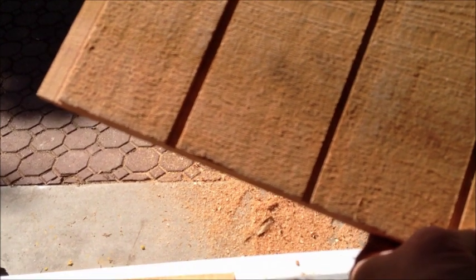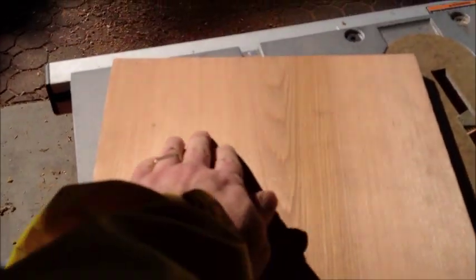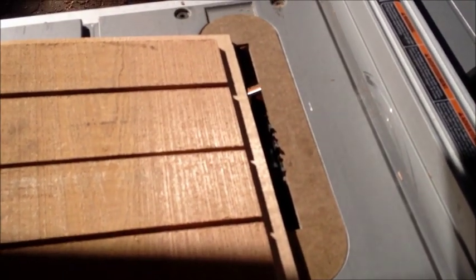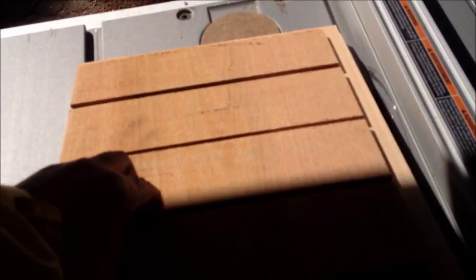We don't want one on the flat side because that's going to be the bottom — I'll staple in some plywood under that. This is a little trick I learned as well. So there's the almost finished board looking good. What I want to do is cut some handles in here, just a handhold, and it's so simple. This is a dado blade, three-quarters of an inch, and I set it just low — maybe a quarter of an inch. I'll take this board, center it so the middle part is on the blade, put it over on the fence, then just drop it and roll it back and forth to put the handle in.